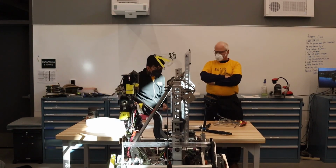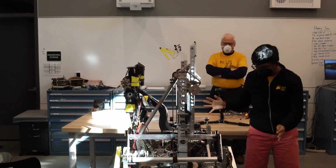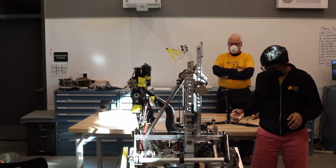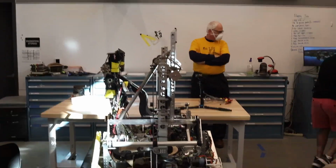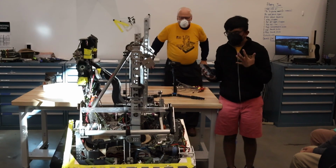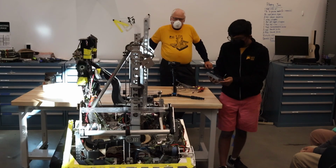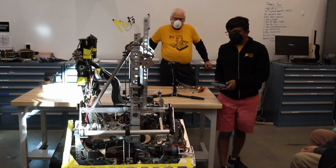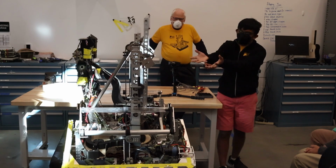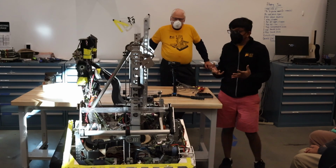So I suppose I can walk through more about the robot. Let's see, microphone. Okay, so robot. A few special things that we've done is, at least on the new Robo Rio, wherever that ended up. You might remember me talking about the combination encoder, the mag encoder and pot combo. That just gives us a nice absolute zeroed intake, or joint. An interesting thing you can think about is everything is an intake. The catapult is just a very fancy intake. The turret is also a very fancy intake, because to software they all look the exact same.